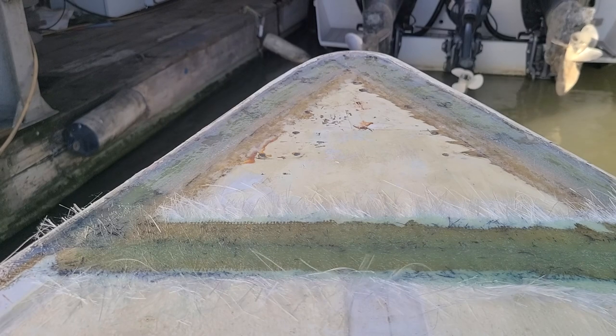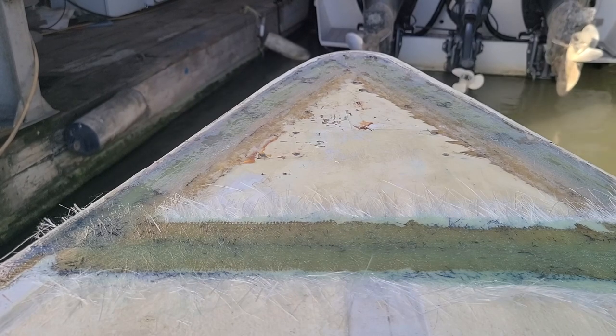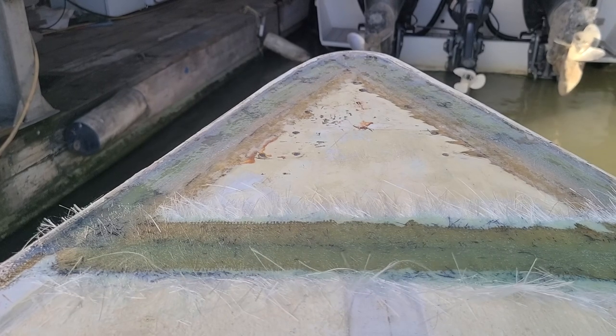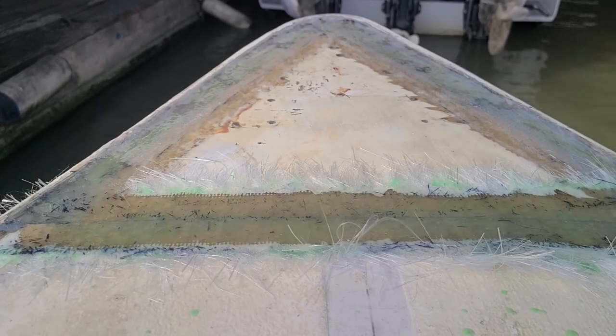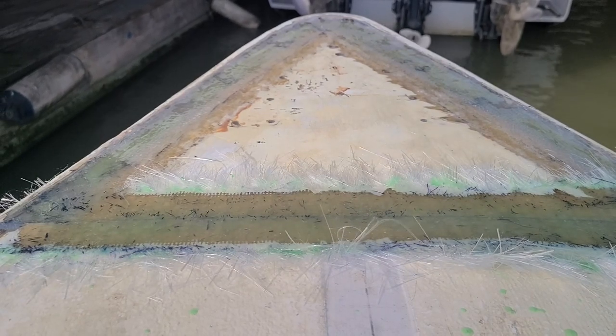CSM is laid out. Yeah, I like it. Maybe I'll go with the CSM only. It looks okay, I guess. Thickness is okay and stiffness should be fine. It's still CSM. So wait until it cured and then I will probably cover with maybe PVA. I covered this whole thing with the PVA, polyvinyl alcohol. So waiting until tomorrow.